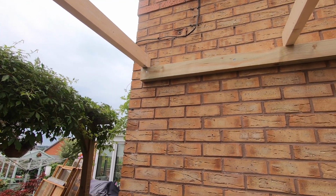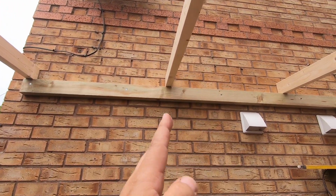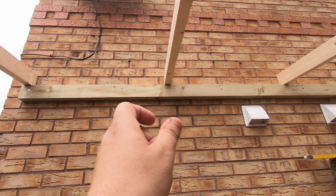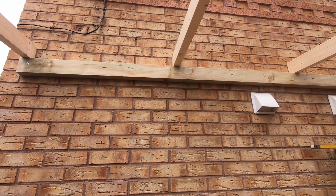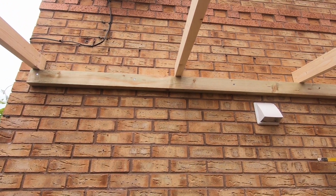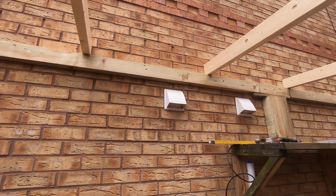and then we'll measure with a piece of polycarbonate, make sure that this one is in perfect place. Now they're measured to 920 centres, so that gives 10 mil inside the glazing bar for it to be clamped down, but we just want to make sure that it's right as we go down. So truss bars, glazing bars, bit of polycarbonate, and we'll just keep moving the polycarbonate down as we go.